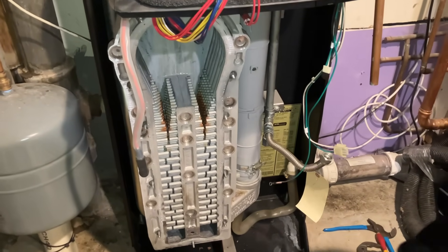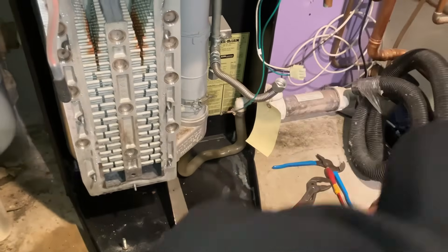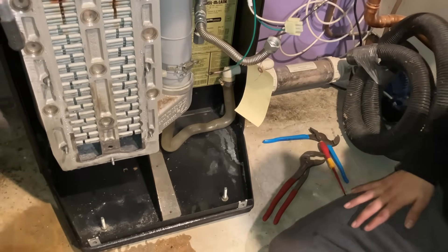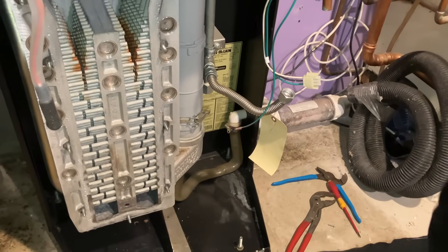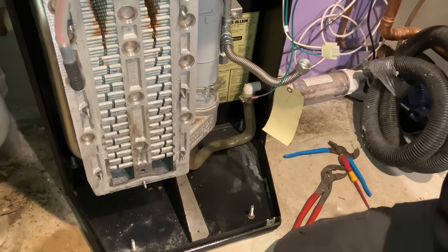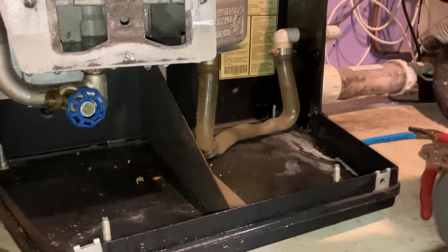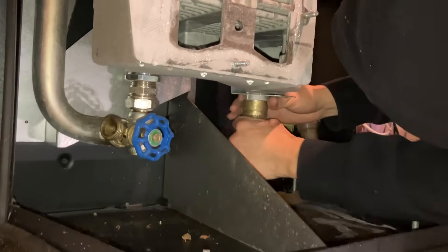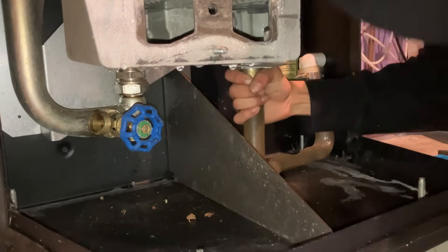Just make sure you follow the instructions and you will preserve the life expectancy of your heat exchanger — this is a very expensive unit, make it last. Next, we cleaned the pin side or combustion side of this heat exchanger with water, forcing everything out of the heat exchanger and the bottom cavity into the trap. The trap is connected to a condensate neutralizer which we're going to replenish the media for shortly. Next we're going to remove that condensate trap from the bottom of the heat exchanger and the PVC piping going out of the boiler — take that out and hose it off in a sink.